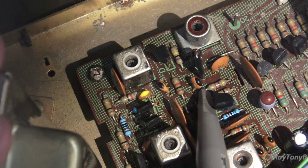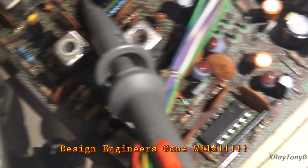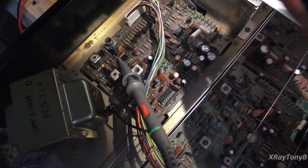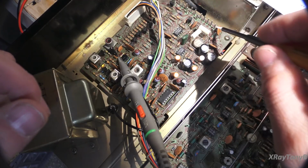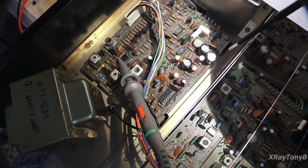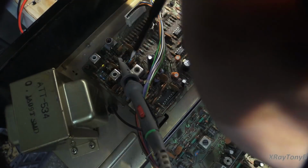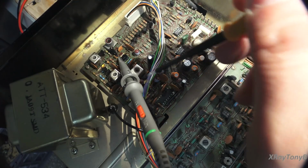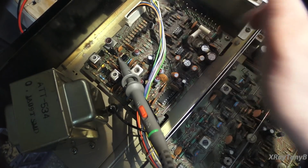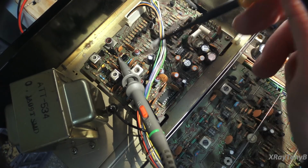Like I said, this machine, I don't know, man, the way it's designed. Definitely a challenge to work on. The other problem is you can't access this board from the bottom. So every time I have to do something to it, I have to take the 4 mounting screws out and flip the board up, and all the wires are attached at this side, so you can't bend them too much or they'll break because they'll get brittle. Each of the 4 screws is a ground plane, and they each need to be screwed down to properly ground this. This doesn't have proper grounding if you don't screw it down. So yeah, there is a ground wire on here, but I don't know that the ground bus connects all the way to all 4 corners. It might, but I'm not taking chances. I screw this down every time. So it's very tedious to remove or replace any component.